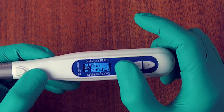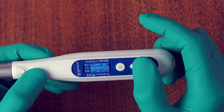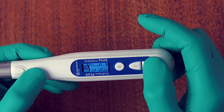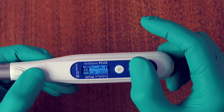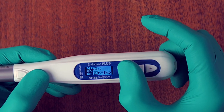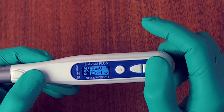Now the OTR limit, which is the torque setting. For memory one it's set at 0.6, but there are five torque settings: 0.2, 0.4, 0.6, 0.8, and 1.0. At 1.0 you get the most torque before OTR kicks in. I've found 0.6 works well as a sweet spot of efficiency and safety. If you're heavy-handed and want more safety, lower it — the lower the OTR setting, the more safety; the higher, the more efficiency. For heavy-handed operators, go down to 0.4 or 0.2.